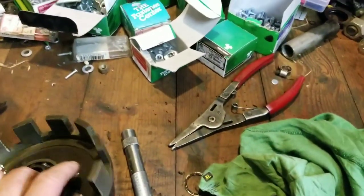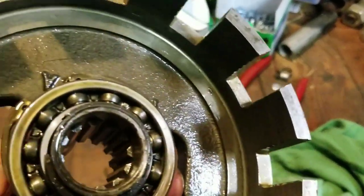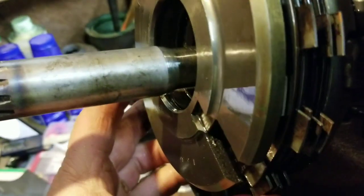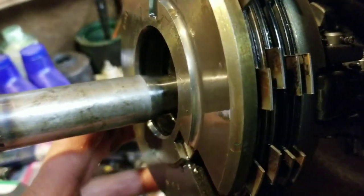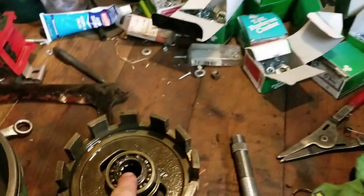All right, well that was easy enough. All you do is go through that window, take that snap ring out of the groove in here, which brings that bearing off — it needs cleaned up — pulls this cage off of the clutch discs, which I'll have to line all back up. They're all out in the open so that should be easy. And then there was a snap ring which ends up back in here in this second groove. Now I can pull the shaft out and put it back in the tractor.